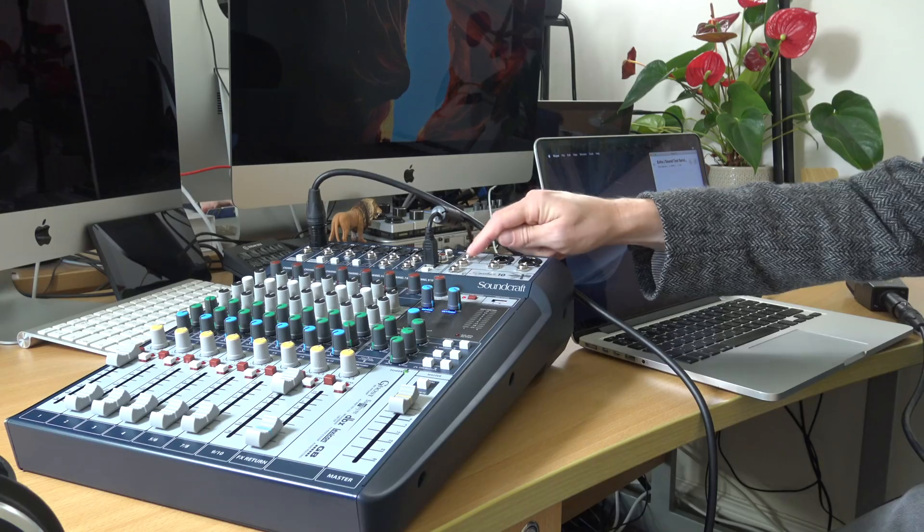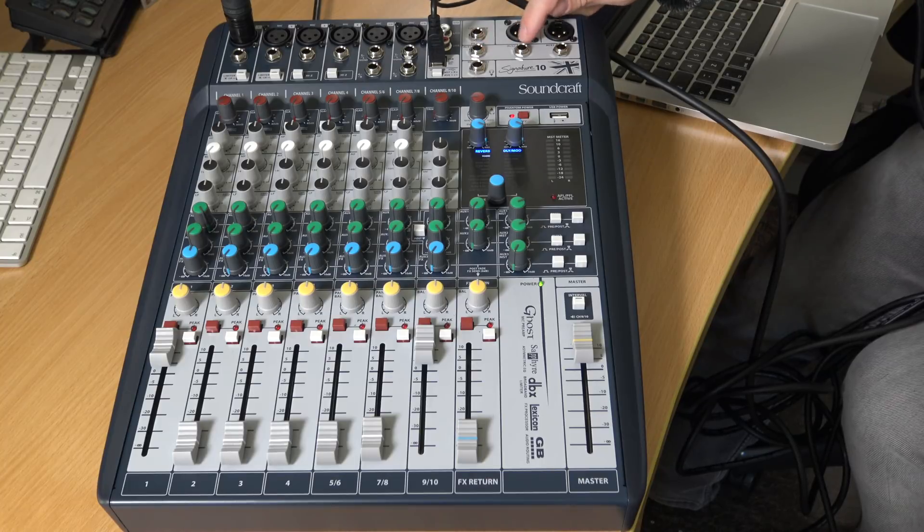So you can separate everything out — no crazy wires. One final thing: if you did want to digitally record your podcast output onto a Zoom H4n, you've got two inputs there. You could easily use the AUX1 and AUX2 outputs and plug them into your Zoom recorder to get a clean feed — channel one and channel two — of your host and your guest recorded onto a backup recorder that is not your computer, in case your computer crashes.